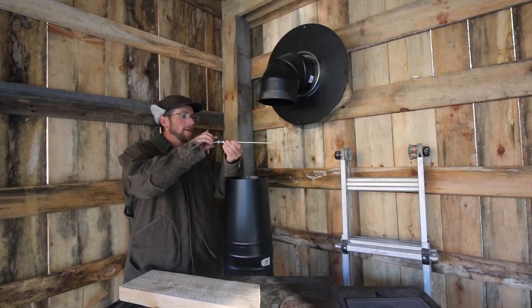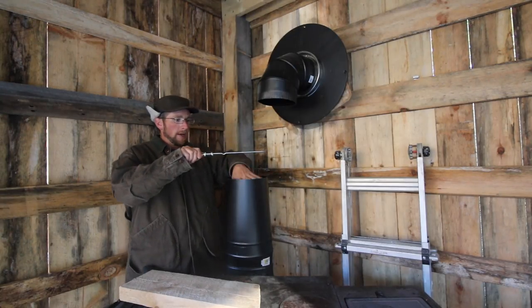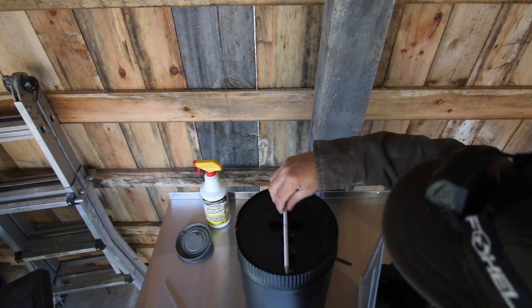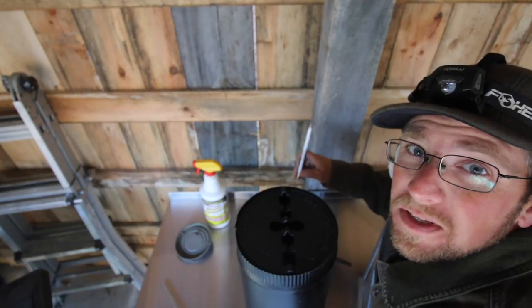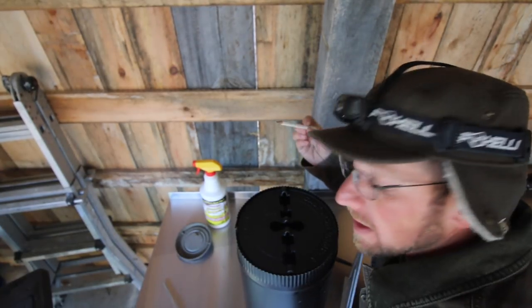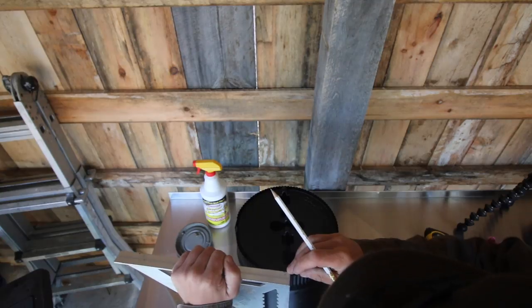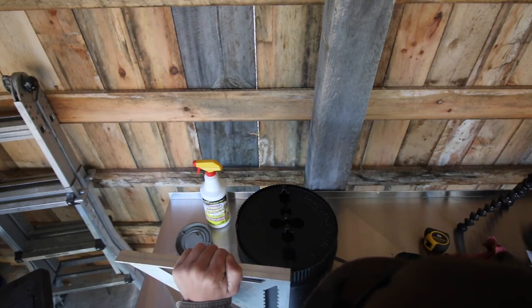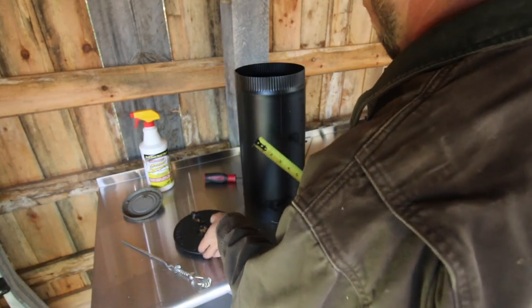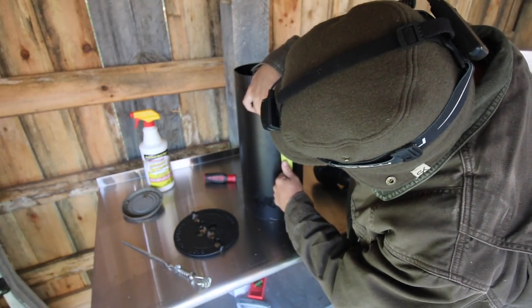I like putting a damper in my stove pipe, so I want to figure out a nice comfortable height. We're looking almost at center of the pipe. If we go too low, when I turn the damper it'll hit the pipe. This next step is always kind of fun to figure out — we need to drill a hole that goes all the way through straight so the damper fits in there nice and even. If you have a 6-inch pipe it's a little easier — you can get a drill bit that's 6 inches long. This is 8-inch, which makes it a little more difficult. This time, instead of just eyeballing it, I've got the damper set in place. I'm going to take my square, mark center, and repeat it for the other side. I'll measure how thick it is — 4 inches — so I'm going to go 4 and a half inches below the ridge to make it safe.